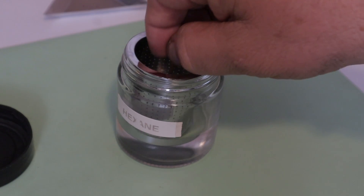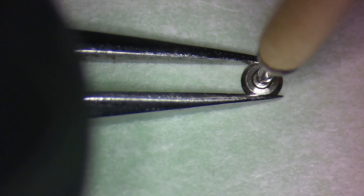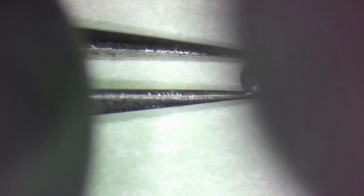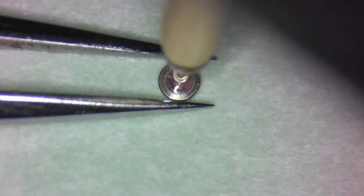I don't want it to be so tight that I have to force it in the hole — it should just barely fit in. I'm going to dip the pivot at the end of my tool into a little bit more hexane or IPA, and just drop it into the jewel hole. You just lightly spin it a few times, flip the jewel over, and repeat the same process on the other side. Then I put it back into the diamond jar and give it a few more shakes just to clean anything that might be there. It's really just that simple.